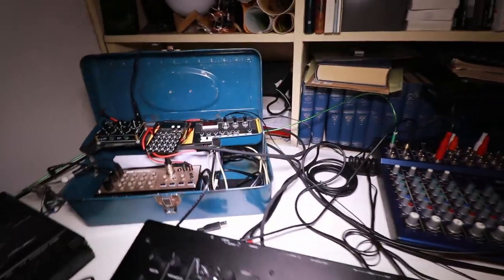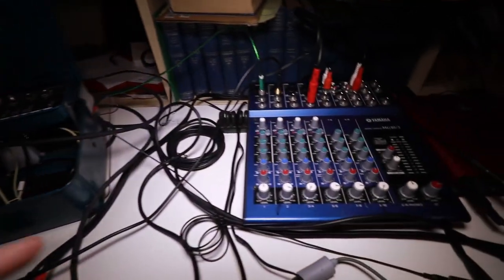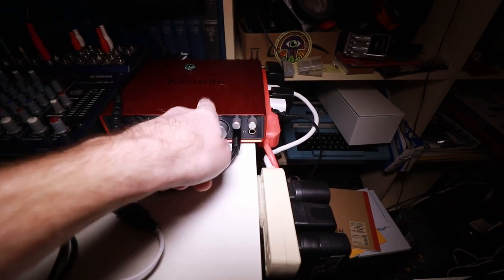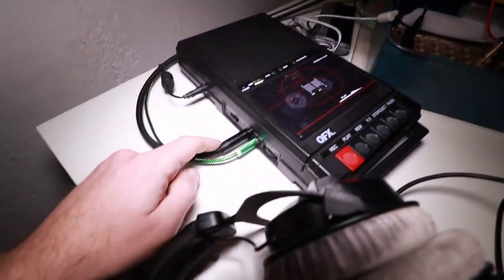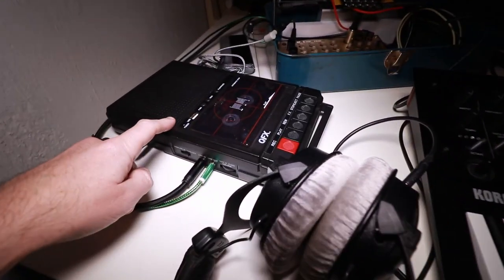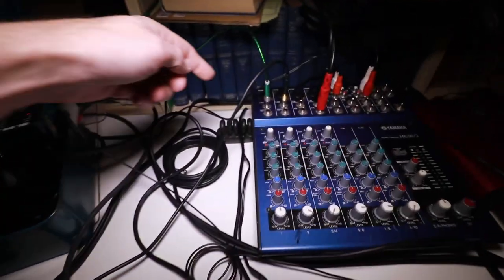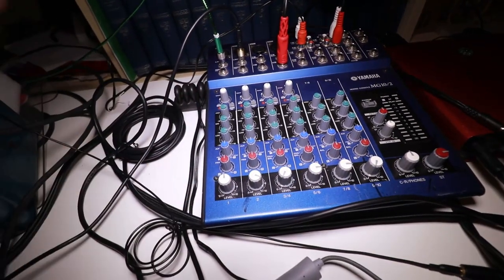The other little tidbit I threw in here is this tape player. The way I've got that routed is it's taking an output from the headphones jack on the audio interface, and that's going to the input on the tape player. So everything I play with all this stuff, I can record to tape. And then I've also got an output from here going back into my channel 1. That's just a mono output going back through the mixer.